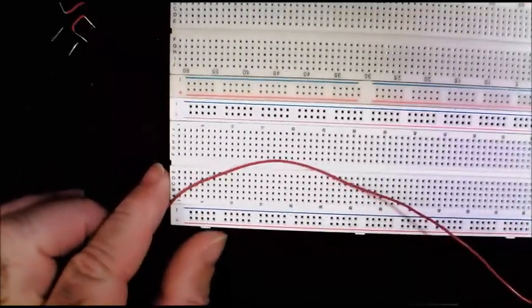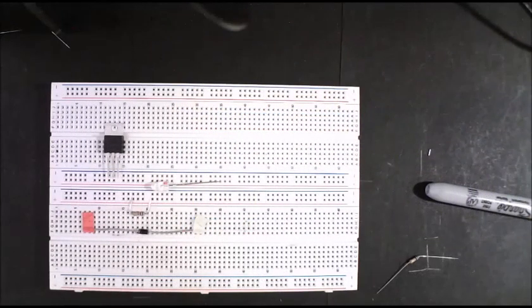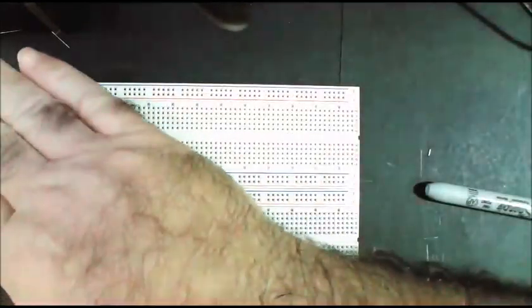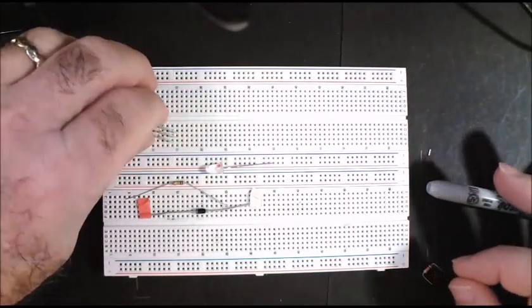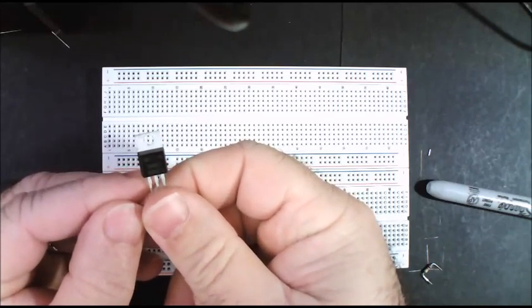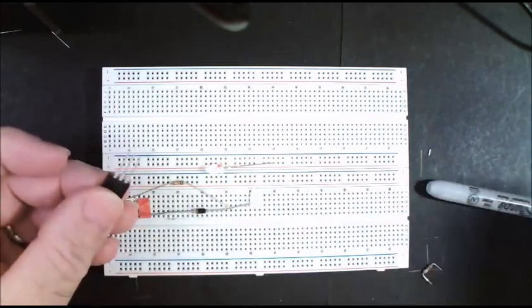This here is a breadboard. We're going to build out the power supply part of the circuit. When you do the power supply circuit, it's really important that you follow these steps exactly, because this is the foundation for your entire project. We have our parts for our power supply and now we're going to begin the build. First thing we're going to do is take the 5-volt regulator, the 78M05. The important numbers here are the 78 and the 05, which makes it a 5-volt regulator.